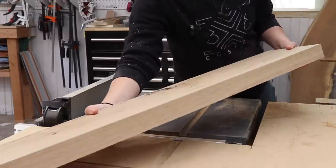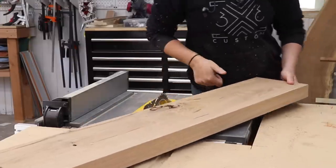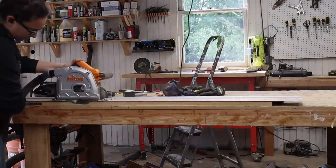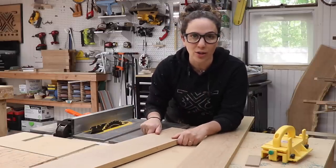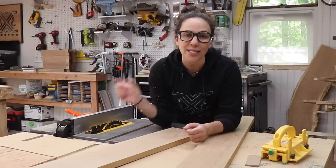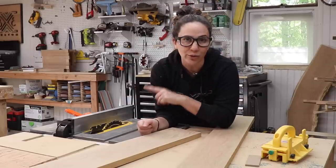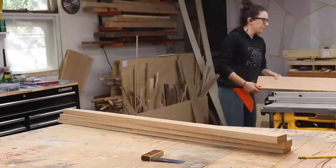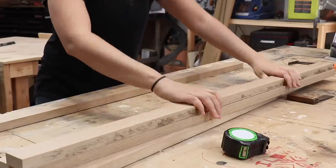Off camera, I milled up this big piece of oak to the same thickness as the leg pieces, and I'm going to rip it into two strips for the stretchers. I jointed one edge of these thinner boards using the track saw, and now I'm cutting them into strips that are the same thickness as the leg pieces. This way it's going to look like the whole bench is made up of the same thickness material. I'll rearrange the pieces and twist them around so that it looks like they're made from different panels.